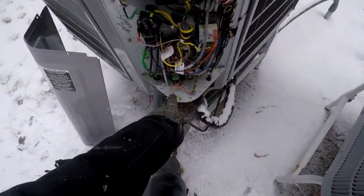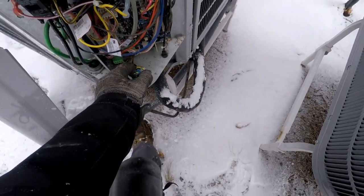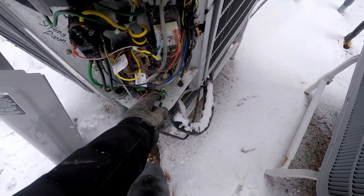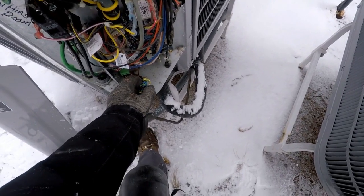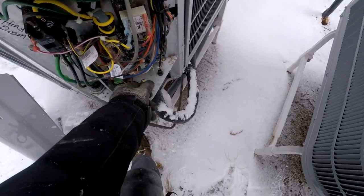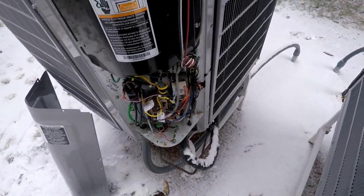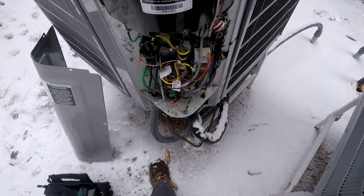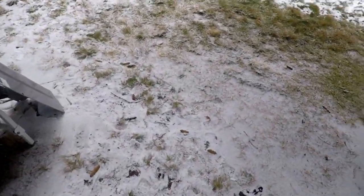These were originally connected red, white, yellow, green. And if you look at these wires, the brown's been stripped back, which we just took off. I used that one last time. And the yellow's been stripped, and the green, I think the blue's been used as well, or at least maybe I just stripped it when I was testing continuity last time. But that's definitely the third wire that's been compromised here. So they're going to have to dig this up next summer and fix that.